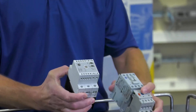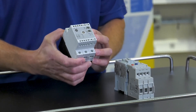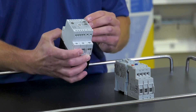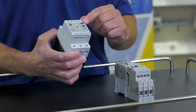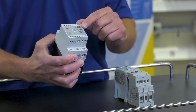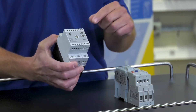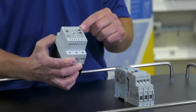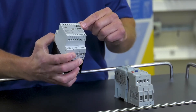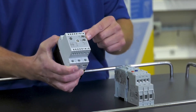The STC will ramp up the voltage like a soft start does, and it can be adjusted with the two dials on the front easily. You have an adjustable torque level and an adjustable time. The initial torque level is adjustable from 10 to 80 percent, and the adjustable ramp time is adjustable from half a second up to five seconds.